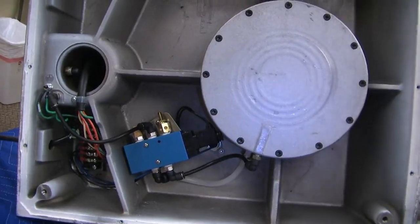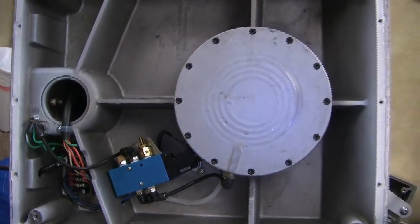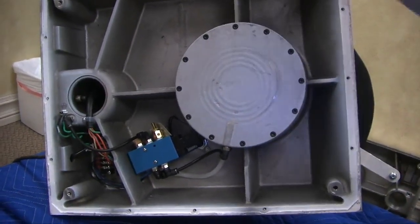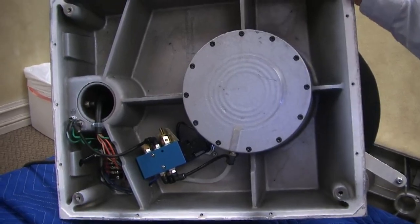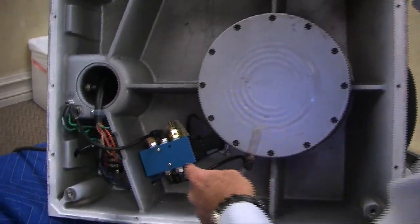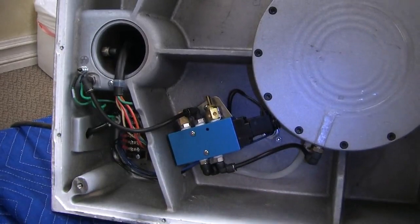Remember, there's always air in the down direction with this machine. Once you plug in the air, not even power the machine, once you plug in the air, you're going to have pressure, always downforce, down. And when we trip the solenoid, it's going to change the valves and the flow through, and bring the air up, and it's going to escape out of here. When it comes down, it escapes out of here on a speed control, and you can see the adjustment feature right here.